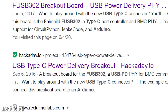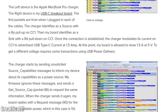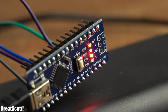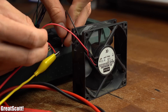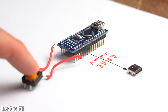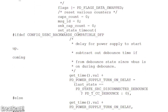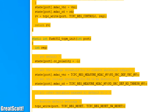While searching for a clearer solution I found Reclaimer Labs, which not only showed an example of USB PD communication but also sells an interesting USB-C Explorer board and a breakout board based around the FUSB302. With the help of some of his example code uploaded to the Arduino Nano, it was possible to select the highest output voltage of the power bank — 15V — which was a great start. But what I wanted was a push button to select between different output voltages. The code was too complex for me to understand alone, so I reached out to him and luckily he helped me. The resulting code clearly shows that USB PD negotiation is not a simple subject.